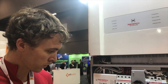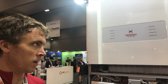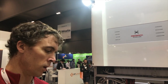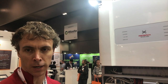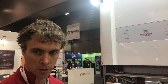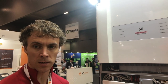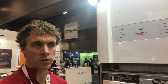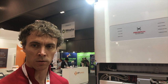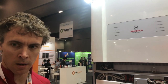The raw specs of the hybrid setup: this is a 5 kilowatt nominal inverter with 4.6 kilowatt charge and discharge — symmetrical power, with 85 amps on charge and 100 amps on discharge. The backup is UPS level backup, so you would put your refrigerator, lighting, and other critical circuits on that. It will do an automatic changeover in sub-cycle, so the computer wouldn't go off if you lost power.